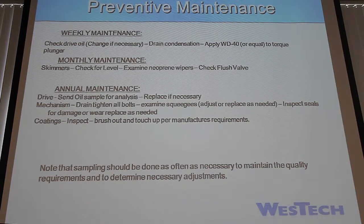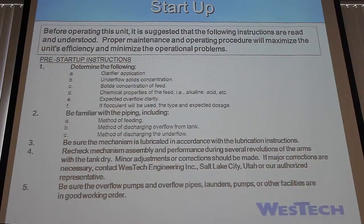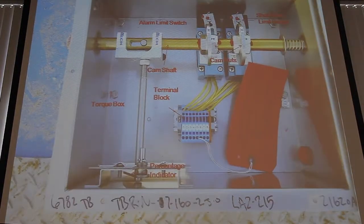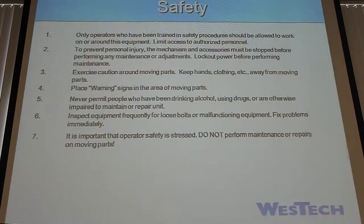So, just from the outside, right there's a little red cap on it. Spray a little WD-40 around that, and then also underneath right there, maybe hit a little bit. I wouldn't spray it directly in the torque box. So I wouldn't spray it inside here, but if you could get some around this part, and also if you can fit some down in this area, that would help that spring just stay moving, fluid. If there's any sand or dust down in there, hopefully it helps wash that out and keep things going.